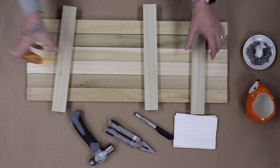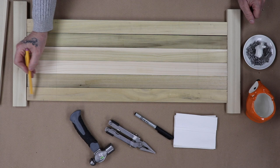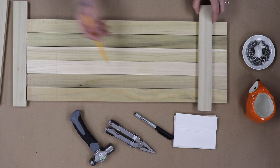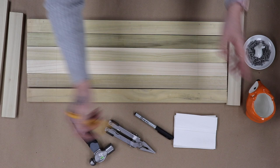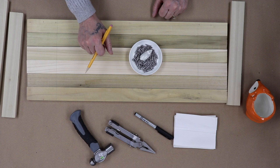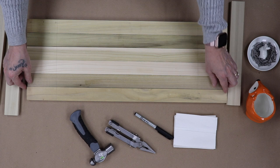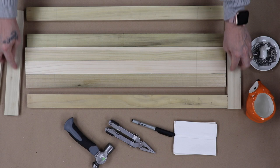As we did on the last one, I made a two-inch tick mark from each end — two inch, two inch, two inch. I put my cleat on the tick mark and drew a line so I know where to put the glue. For this project we are going to beef up the glue because we are only using nails, not the brad nail from last time. You will need a little more stability, but that's going to be fine. We're only going to worry about board one and six, using one as our guide for the width.